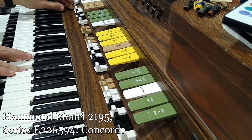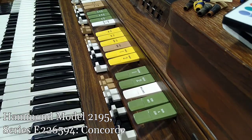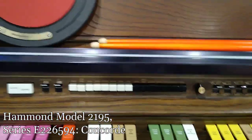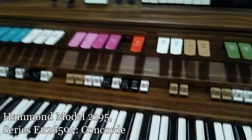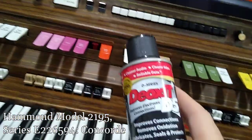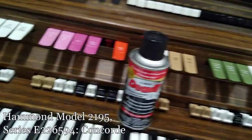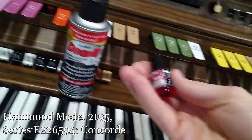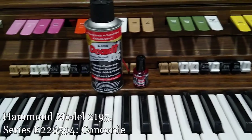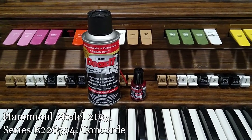So it's the same thing everywhere. There are other little quirks — some of the percussion doesn't work quite right. One of the top lamps still turns on and off, but the pedal board lamp is no longer working. The idea now is to get in there with some of this stuff and clean some of the electrical connections. I got a spray can and a paint-on bottle and we're going to deox all the connections in this organ and see if it sounds better.